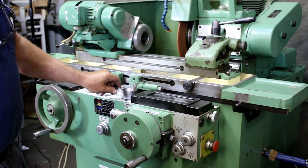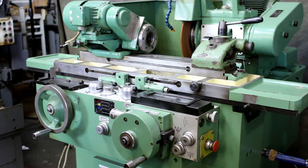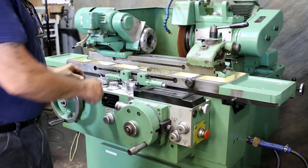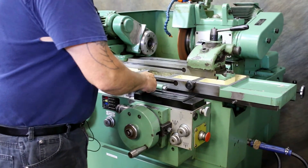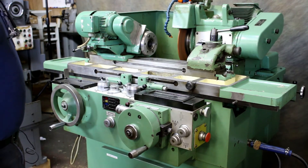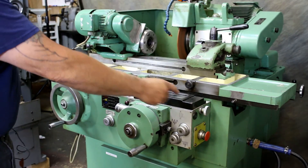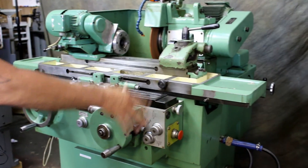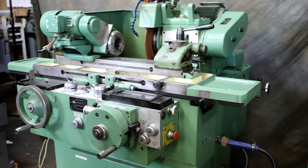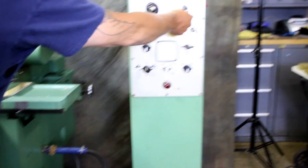When we go back with this lever, the headstock will stop and you need to stop the table — that's the semi-automatic cycle. Now to go fully automatic, there's a fully automatic symbol on here and all these levers need to be put into it. There's also a set of pointers right here which is part of the automatic cycle that the operator would set for stock removal, safety, and also where your coarse feed ends and your fine feed starts.